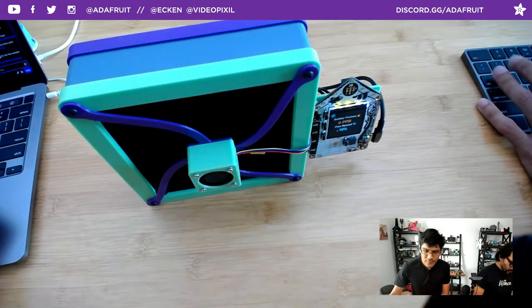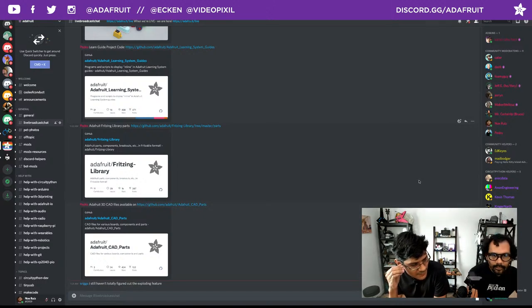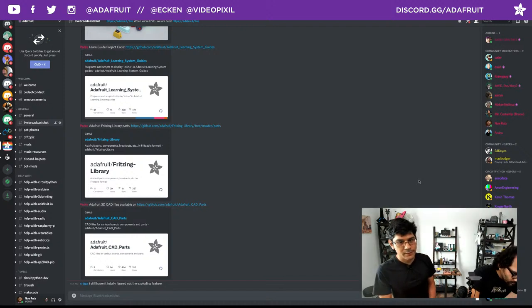Yeah, Stuart had a good comment. I was wondering more about exploding animations and using the animation workspace in Fusion 360. Yeah, there is a layer by layer one I have, so Pedro will pull it up, and it's just a good introduction to it. I should really revisit some of the tips I have. I'm learning a lot of new things with animating huge amounts of hardware screws. I found that grouping screws into a component helps keep your timeline from just being this massive scrolling thing. But it's relatively easy to animate parts in Fusion 360.